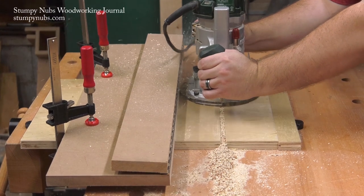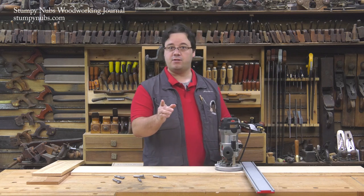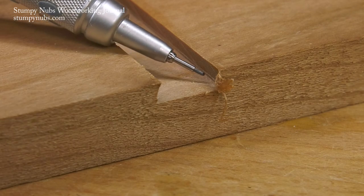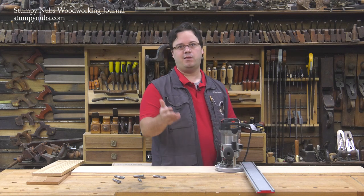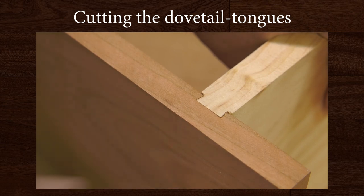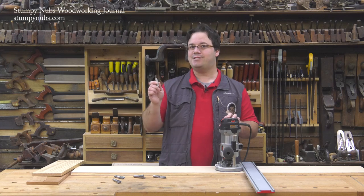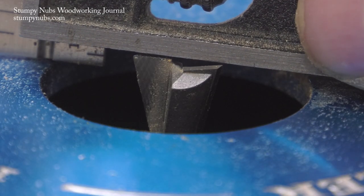When you cut, move your router from left to right so it naturally pulls toward the edge guide for a nice straight cut. Watch out for tear-out as the bit exits on the back side — this can ruin a good-looking joint. The easiest way to manage this is to rotate your workpiece so the bit exits on what will be the back edge, where it's unlikely to be seen. Or you can leave your workpiece a little wider and trim the tear-out away when you rip it to final width after all sockets are cut. While cutting the socket is a handheld router operation, I think it's far easier to cut the matching tongues at the router table using the same dovetail bit. Use a depth gauge to measure the depth of your socket and transfer that to the height of your bit above the table.